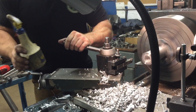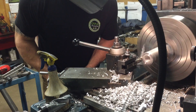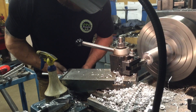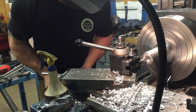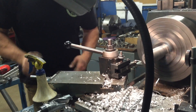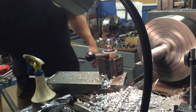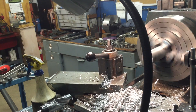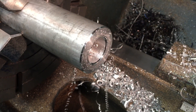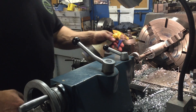Clean that up after I knock a few things around. So we're going to put a nice little chamfer on there, run that over, hit the inside, make that nice and pretty. And that finishes up the operation. We're going to go into tapping. But first, here's a quick look at what we've got as far as the finished product at this step — so drilled and chamfered.